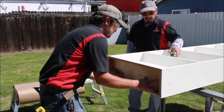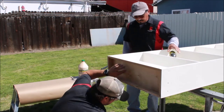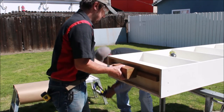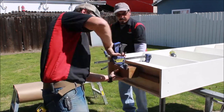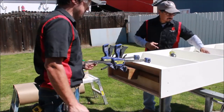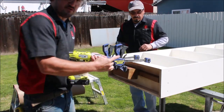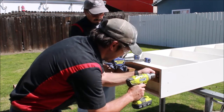So we're going to put this in place. There's a bit of a bow here, so what we're going to do is strap that down, suck it in with this 2x2, and then lock it down with this 4x4 to transfer the load so we have full adhesion underneath. While we know this is going to be sucked up tight because of our board, we still want to reinforce it with screws so we have more of a mechanical attachment rather than just the glue holding it up. We're going to lock this in with about six screws — one in each corner and two down the center.